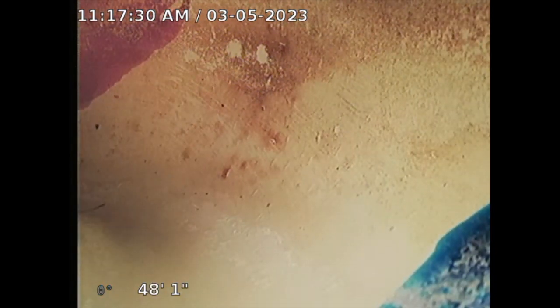I'm going to keep going here. It's starting to get tougher. I'll turn on the water in a second — I like to get it dry. The bottom is 38 feet out. There's a clean out at the front, so this is underneath the house. I'll put the camera at the front clean out as well and see how that looks. Turning off the water now to get a better picture. It seems to be flowing properly. I'm retracting my camera — I went about 40 feet interior of the property.